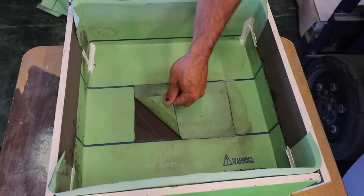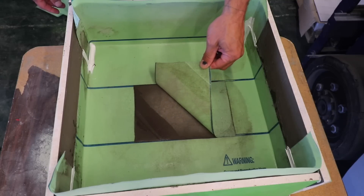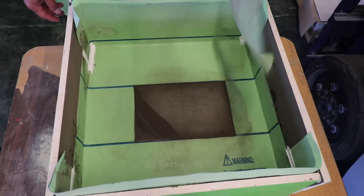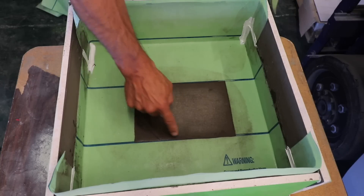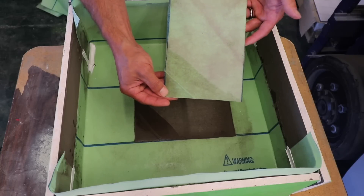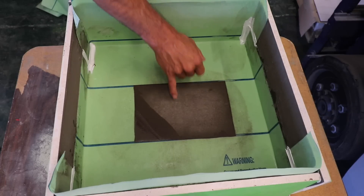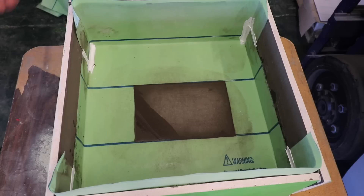First thing I'm going to do is peel back the membrane, and this is peeling really easy — I mean, really easy. As far as moisture penetration, you can see here — this is where I had peeled up because I wanted to give it a path to soak through. For the most part, the fleece is dry. The thinset — you can see this ring here as far as moisture penetration — I would say that's a lot less than I'm seeing with the Schluter KERDI.